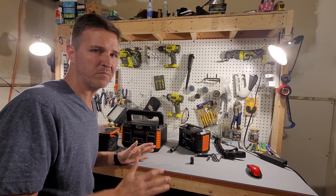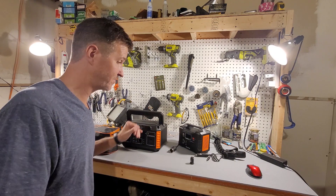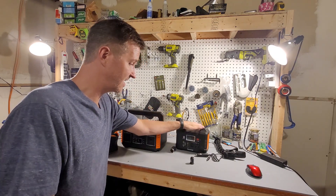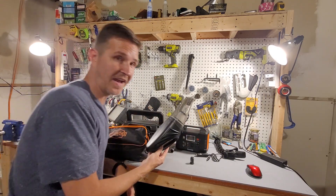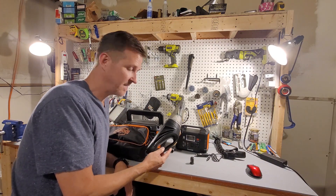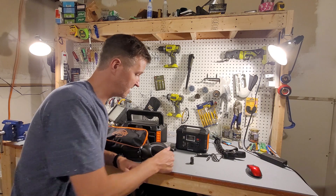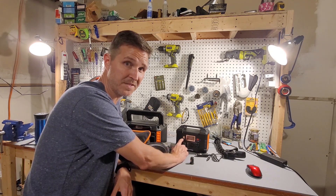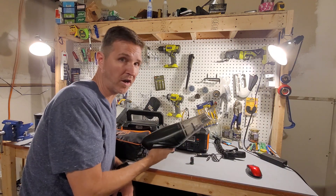Sorry, this video is all over the place — I'm excited about seeing what this thing can do. In my previous video while camping, I tried to use this vacuum to vacuum out the tent and it didn't work with the small FlashFish, because that one only powers up to 5 amps at 12 volts — that's only 60 watts — and this vacuum uses over 100 watts.